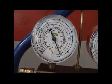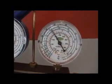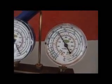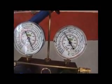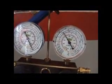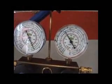After you set the gauges to 10 bar, you sit and wait. Lock the bottle off. If you can see a drop, you've got a leak. It doesn't tell you where it is, but it tells you that you have got a leak — you must find this.